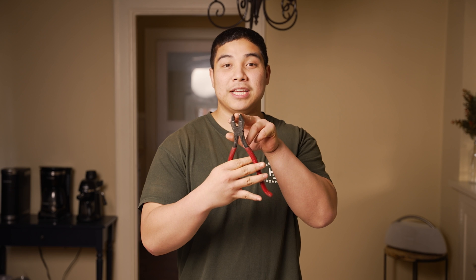You might think the spring is easier because it opens the pliers for you, but trust me, it's going to slow you down. You're going to be in a position where you have to open up the pliers with your hands. You're going to want to open your pliers with either your index finger or your pinky finger. When you open it with your index finger, it allows the teeth to open up even more, so you don't have to be as accurate when you go and grab stuff.